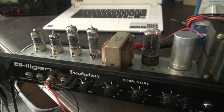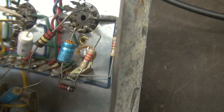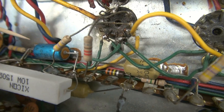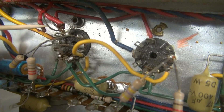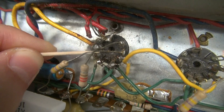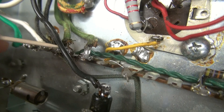Let's get all that cleaned up and give it another test. Here are the items in immediate need of attention. Take a look at these little electrolytic caps — they're about 20 microfarads and the ends are pretty much blown right out of them, so they're obviously bad. Got another one over here which goes to the cathodes of the output tubes — got to change that. And then we've got to fix up this wiring up here. Got a lot of bare conductors showing. We're also going to try to clean some of this arcing off the chassis, but I do not see damage to the tube pins. Then there's the power distribution — this filament line is pretty crazy and will need to be cleaned up.